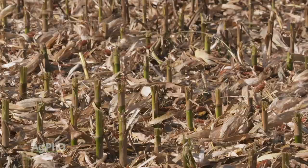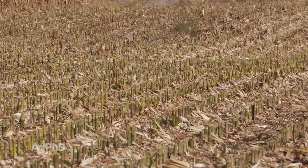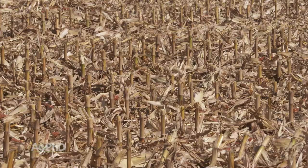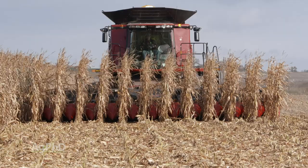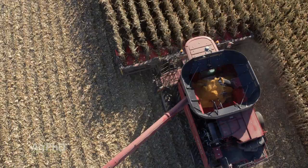We can also chop a little bit higher and leave some stalks out there, and we've found that allows the residue to stay in place and not completely blow to one end of the field. We were worried about that — will all the leaves just completely blow away? Not so if we leave our stalks standing about 18 inches tall. So by doing the chopping corn head, that's been a nice thing for us to get an even spread to begin this process.